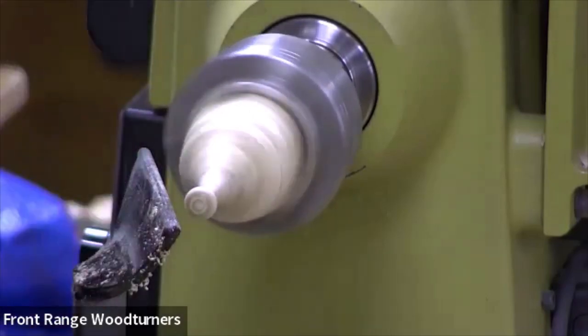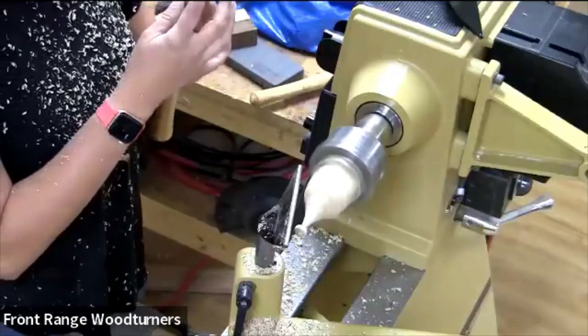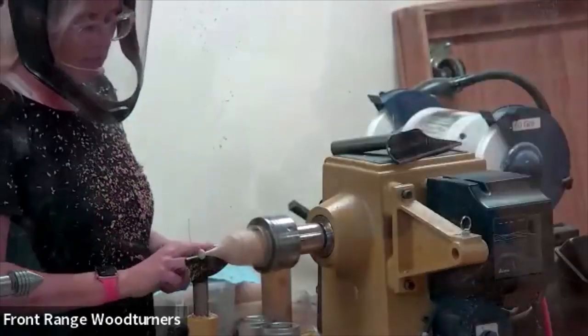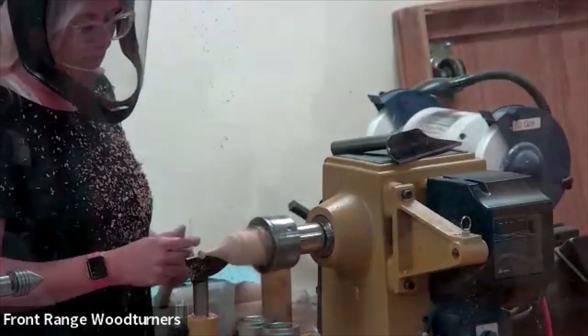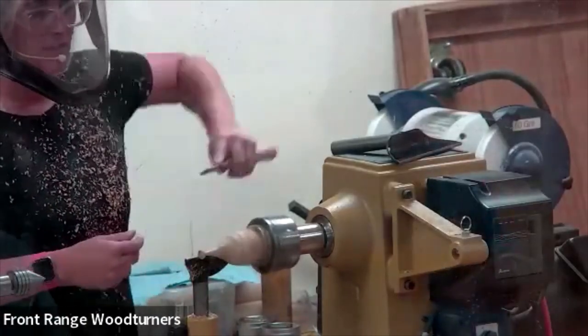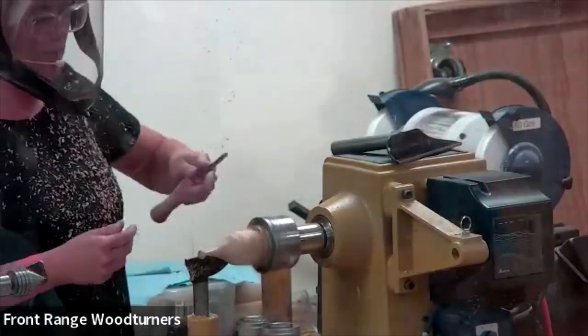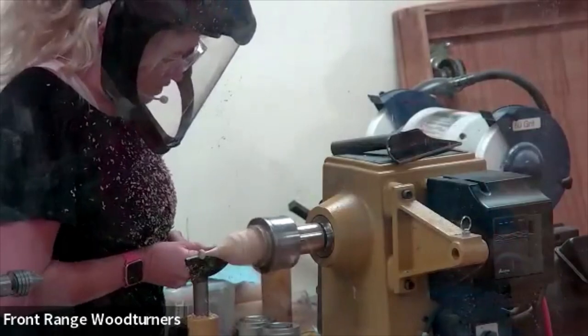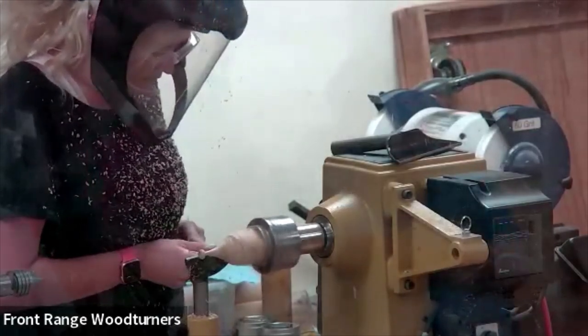And when I'm holding my tool, I'm holding it right by the ferrule with my forefinger on the stem, and then pushing downward pressure onto the tool rest. My body moving left and right is what's controlling the movement of the tool, not my arm going back and forth, and I'm not jabbing it into the material either. Just let the tool cut for itself.